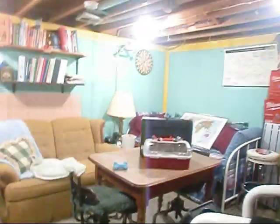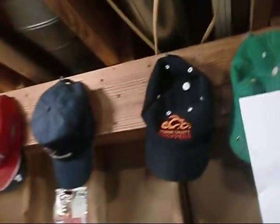But getting back to our PEX, here in the shop area, we actually 90'd up through the floor. I used a 7/8 SDS to my Bulldog to drill down through the floor here, through that porcelain tile up top, and then down through the wood here. But utilized a fitting that my good buddy Al, he's a great plumber buddy on here of mine, Old Kid 888, turned me on to this one fitting right here. You can actually conform your PEX into a 90 without having to put a fitting in.